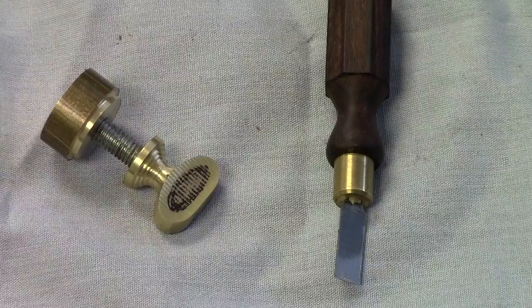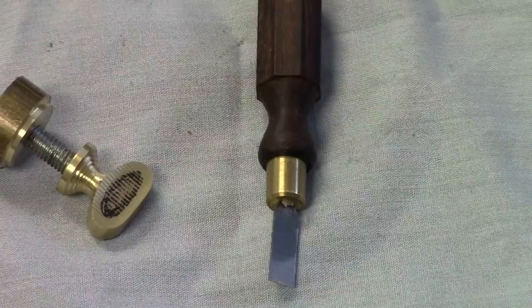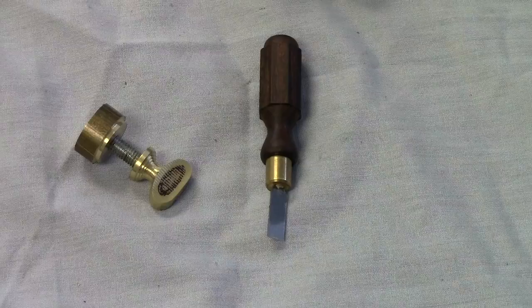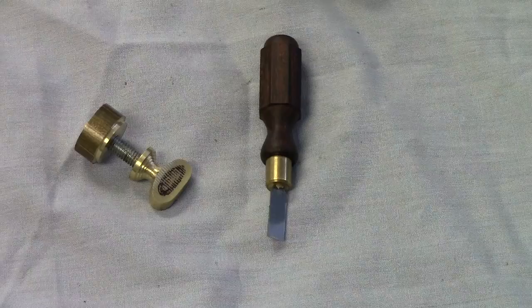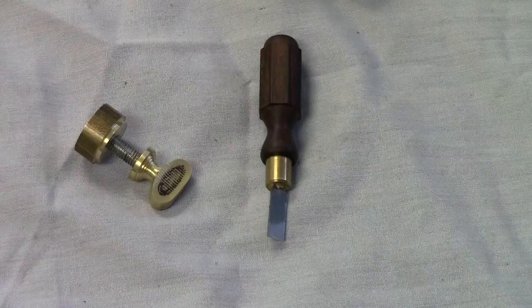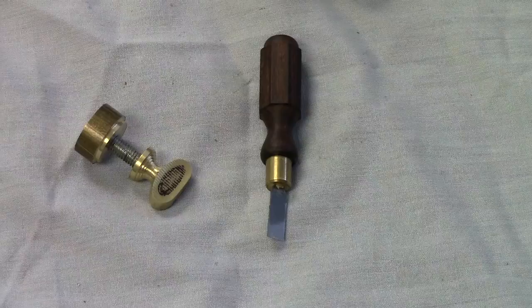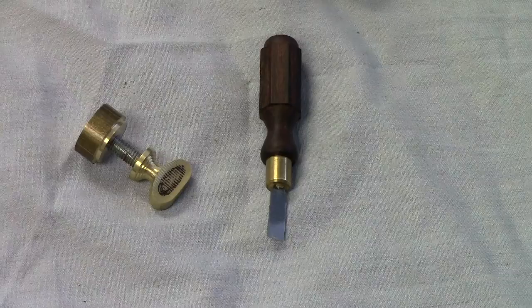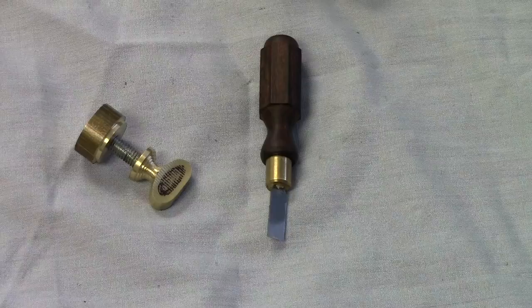The little tool shown to the right is a little small scraping tool that I made out of 1/10 spring steel. It's sharpened and turned just like any other scraper, woodworking scraper, card scraper, or whatever. But I found on your final turning, before you remove your turning profile, and this is before you've gone to the horizontal mill, you can use this little scraping tool. It's very flexible, and just a little light touch, it's surprising how quick that little burr on that tool will polish and sculpt and level out any portions. And it's much faster and much quicker, and in my opinion, gives you a lot brighter, smoother finish than sandpapers with a lot less mess.